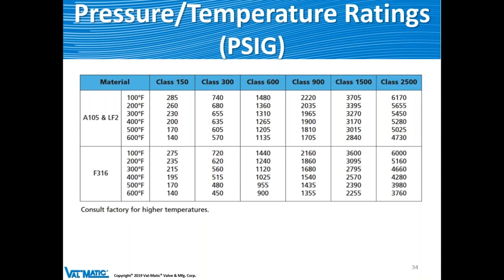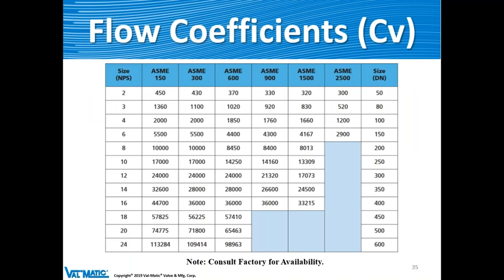The chart on the right shows temperature limits for each plastic and rubber material used. A pressure-temperature rating chart from ASME B16.34 is also provided — if a customer gives you conditions like 400°F at 900 psi, you can cross-reference and determine they'll need a Class 600-pound valve. Flow coefficients are also available; since our valves are full-port as standard, the bore matches the pipe's inside diameter, so Cv is rarely a limiting factor for engineers.